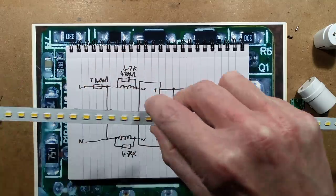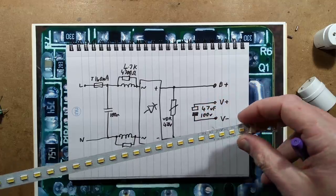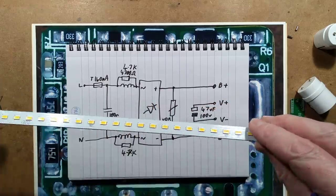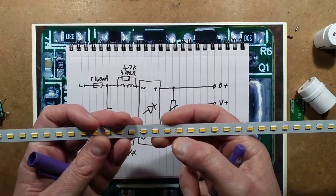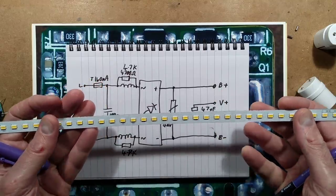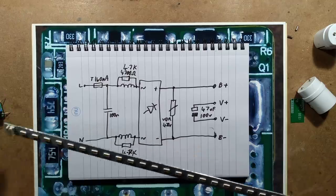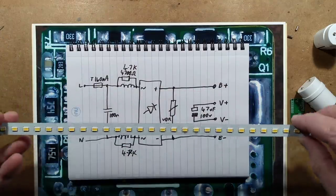The output goes to a 4-pin connector onto the LED circuit board. The board has four tracks — two outer tracks run the full length supplying DC to the driver at the far end, plus two inner connections going to the LEDs. There are 46 LEDs total: 23 in each half, connected in parallel, each a single-chip LED. The voltage across the panel will be around 70V. Having two parallel halves also lets Samsung use the same panel with different component values in a 110V tube.